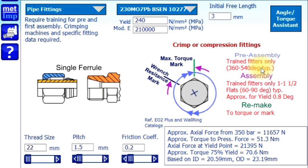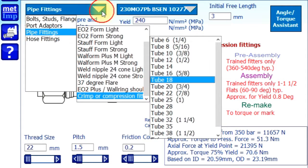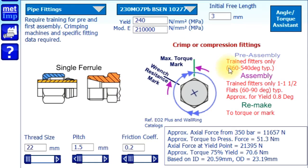We've been through all the catalogues and put these angles in here on all the different sizes. I was concerned because a lot of fitters just say, 'Oh, we know it's quarter of a turn or half a turn' — and that applies for a range of sizes and a range of fittings. If you know what you're doing, that's fine, but it's difficult to remember them, so they're all in here with all the different fittings. You'll have your pre-assembly, your assembly — because once you've re-clamped it in and smoothed it all out, the next time it's not quite the same — and a remake.